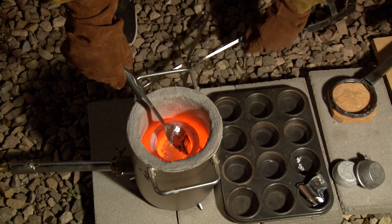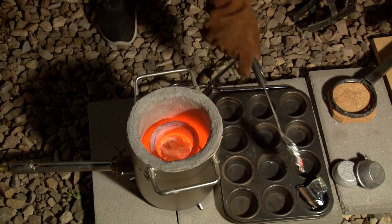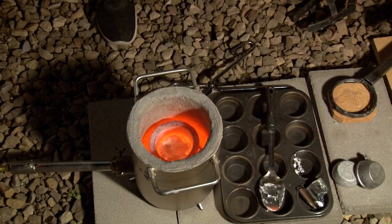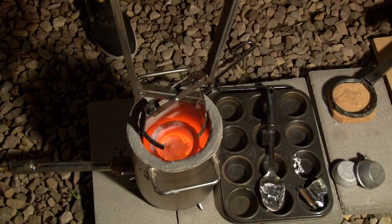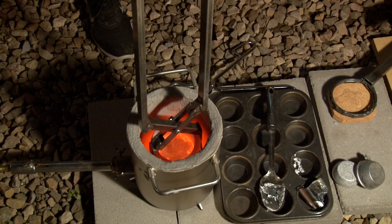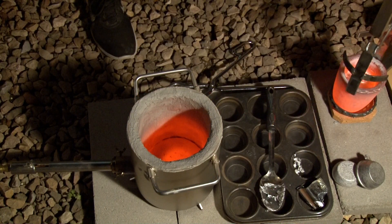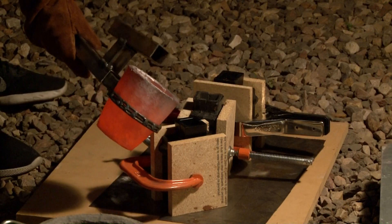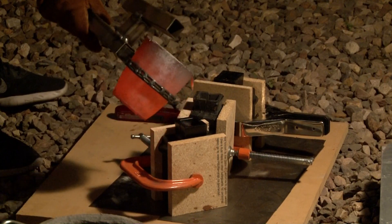I've been asked about getting rid of dross — I just remove it with a spoon. I don't think there's really anything you can do about impurities in a home setting other than just don't put in aluminum that has dirt on it, so you don't have to worry about impurities floating around. These are lifting tongs I welded up, and I also have a pouring tong I made with a little slider on top so that if the crucible gets a little squirrely it doesn't come all the way out.